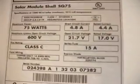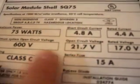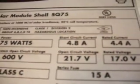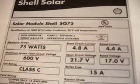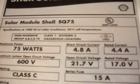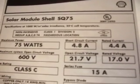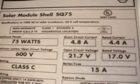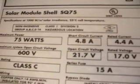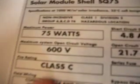So what that means is all these values that we're looking at regarding wattage, voltage, amperage, they all change with environmental conditions. And this module says 75 watts. It may actually produce close to double that in certain conditions, so you need to be very careful when you're designing these systems that you actually realize that these modules can actually produce far more energy than what they're labeled at. And it's the same with this voltage rating here.